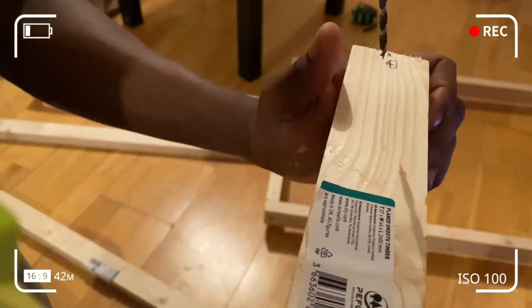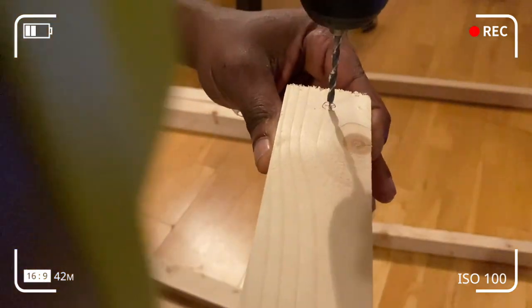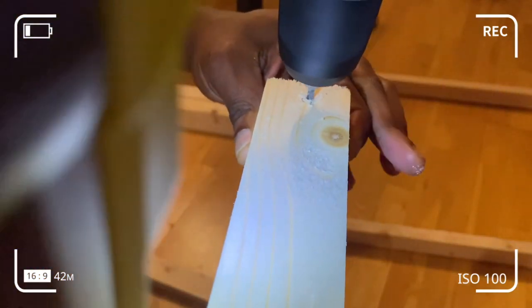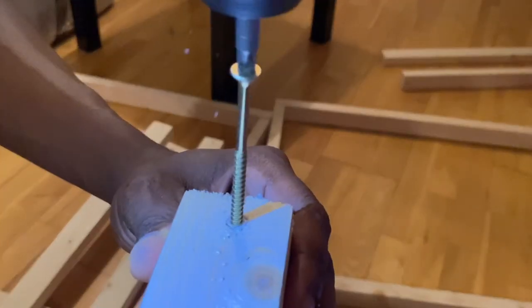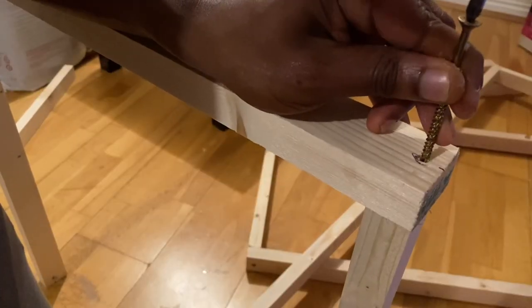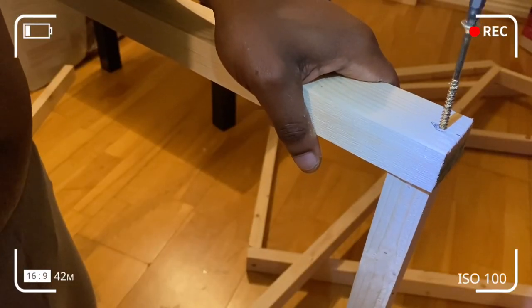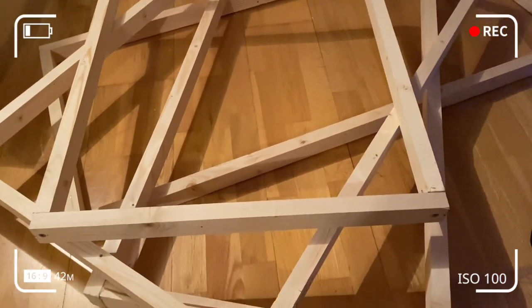Repeat and reproduce the process and pilot all four corners of the acoustic frame. After piloting, apply a small drop of Gorilla Glue between the long and the short side at the piloted hole. You can also spread the glue, then screw in the two-inch screw through the long and short side. Vary the speed of your drill to the slower speed — switch one — to prevent the drill from going too far through the flush profile. Switch two is for drilling.